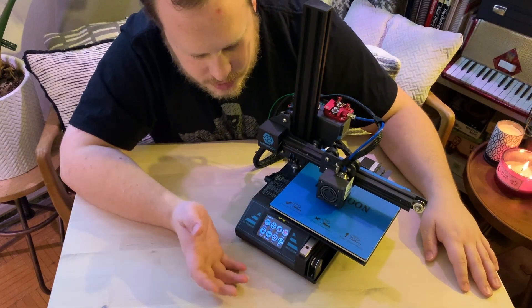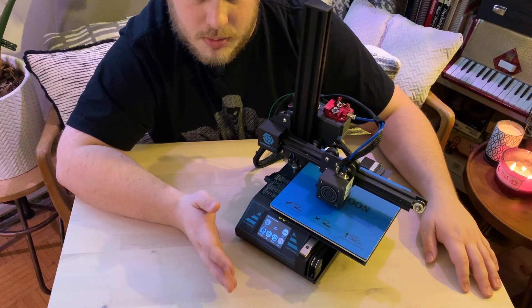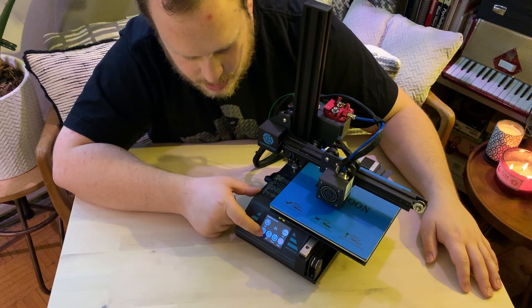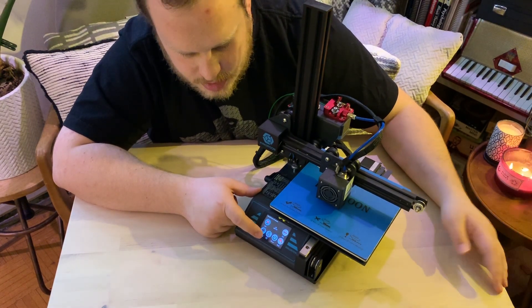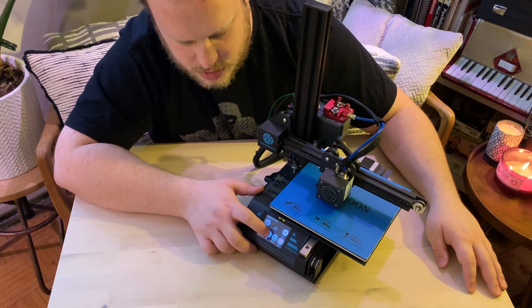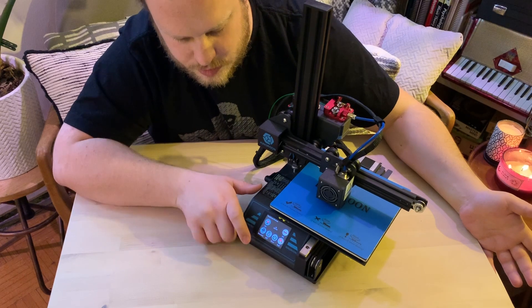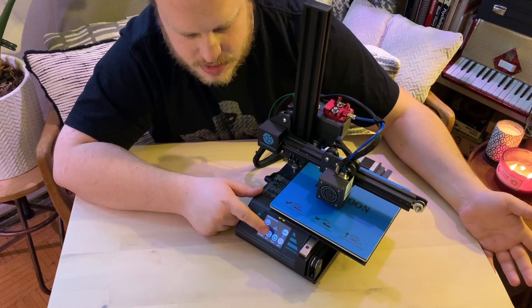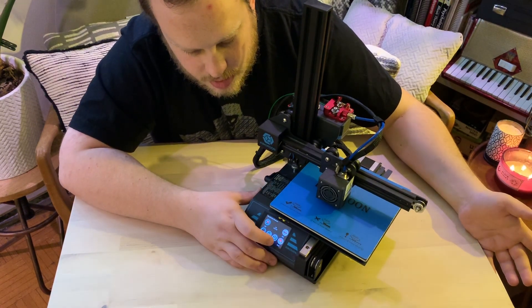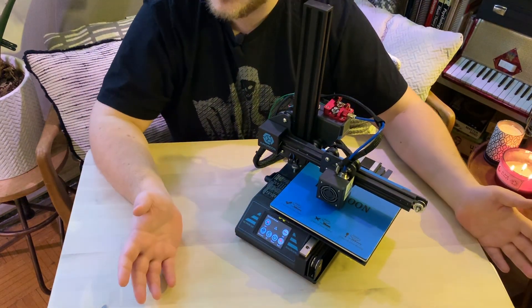Now I'll go through a few other options on here just to give you guys a quick run-through in case you're not familiar. You can preheat the extruder, which is great for saving a lot of time if you're going to be doing a long print job or troubleshooting. You click this button and it switches between the heat bed and the extruder. You select which one you're going to be heating up, then here you select the temperature. It's set to 10 degrees Celsius increments and you've got plus and minus. If we press this you're going to see it increases by 10 degrees. If we change it down to one, it'll only increase by one. Then you press this and it will run the preheat procedure.